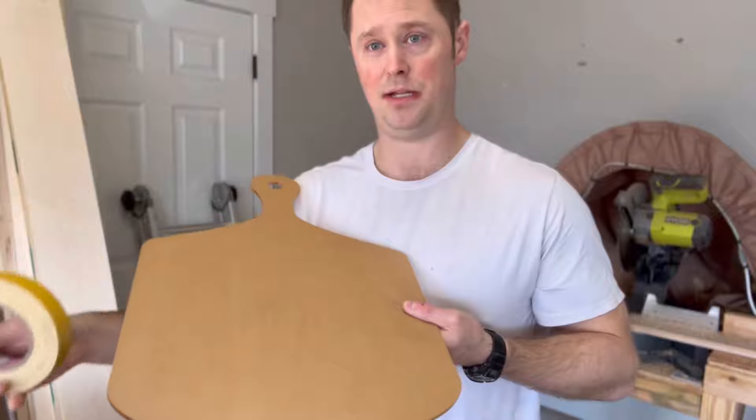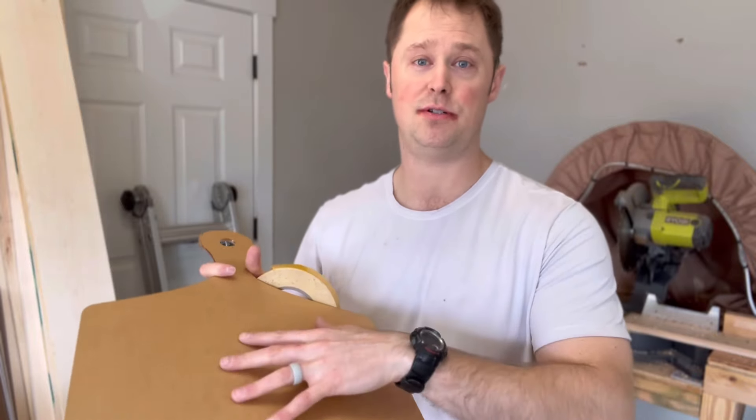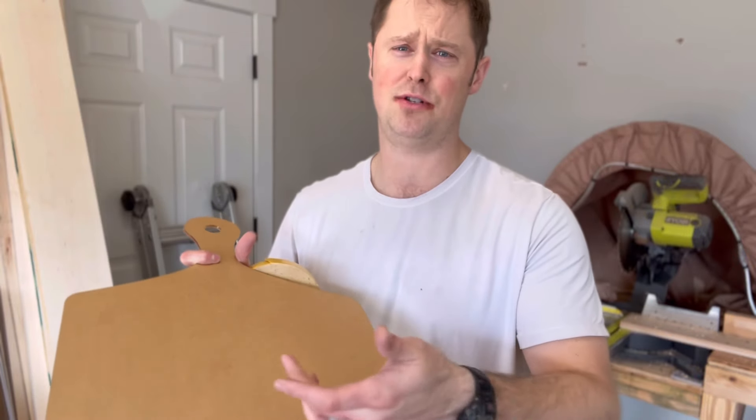You'll definitely want to tape around the corners of the template. I am going to use XFasten. My advice is to tape the perimeter as much as possible — you can't add too much tape to your template. You can definitely not add enough and have the template slide on your wood. Make sure you get the perimeter of your template and maybe one or two stripes in the middle.